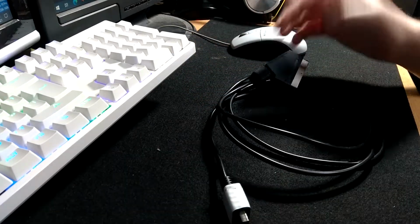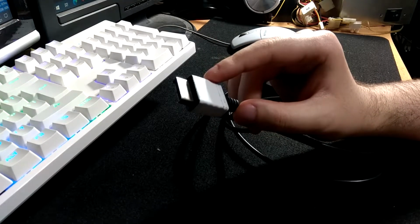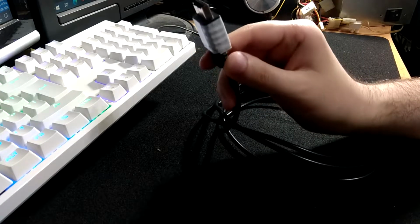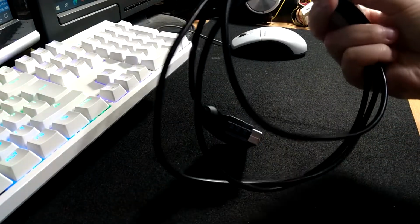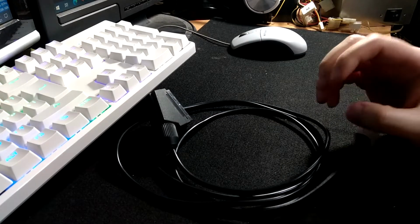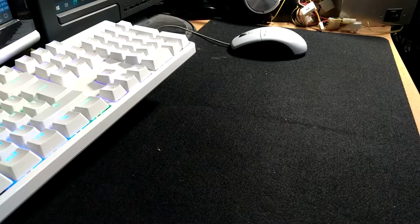It's what everyone does. To get slightly better video quality, you can take that composite pin inside this connector and move it over to the Luma pin. This one does have the pin for it, so it will basically just get sync off of the Luma pin, and that worked really well. It gives you pretty good video quality, although there's still a bit of slight bleeding because of the nature of the cable. It doesn't have very good shielding, but it does get rid of the checkerboard pattern that you see on solid colors, for example. Alternatively, you can also use C-Sync, but that will also not help the crappy quality of the cable.